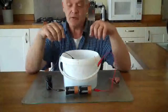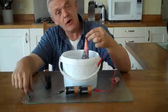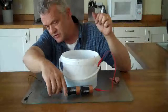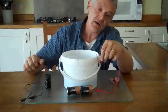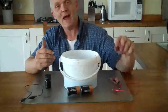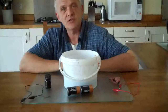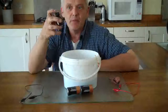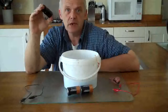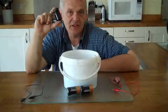I've left this about three or four minutes, and as you can see it's beginning to plate up quite nicely. The pink colour is the copper being deposited on it. Before anybody tells me there are better ways of doing this — I know there are. This is just a quick demonstration to give you an idea of how to go about it and show that the ink works. The whole video is really about the ink — this little material that you can paint on any organic substrate: wood, leaves, flowers, paper, lots of things — and it allows you to electroplate. That's the whole point of it.